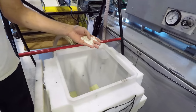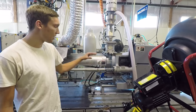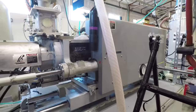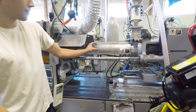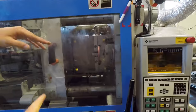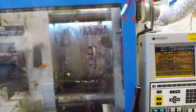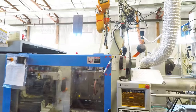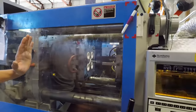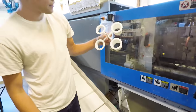So if you were doing lime green, you'd see little green specks in there. It gets dropped down into the barrel, which is wrapped in heaters — gets it real hot. Inside is a screw auger, a big screw that's spinning. Once there's a big molten mass of plastic in front of the barrel, the screw stops spinning and shoots forward, pushing all that plastic into the mold. We've got a big crane overhead — we can swap the mold out in about 15 minutes. Then the ejector system comes out and pushes the part out. And here are the plastic dually grommets.